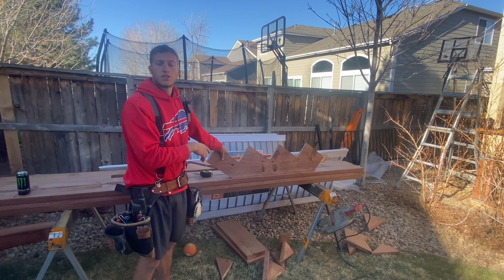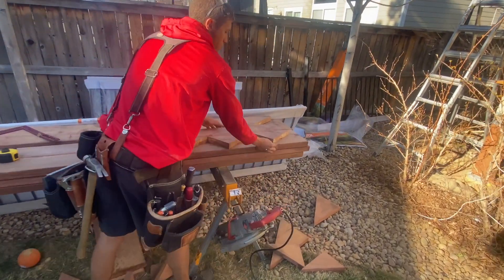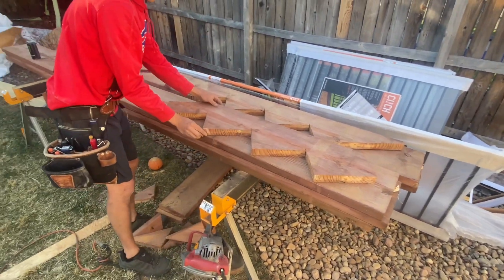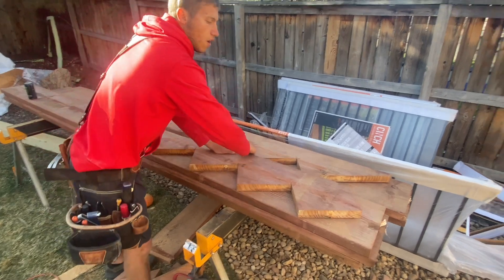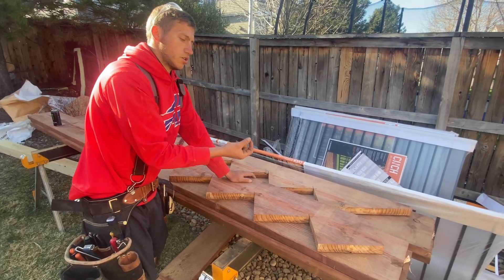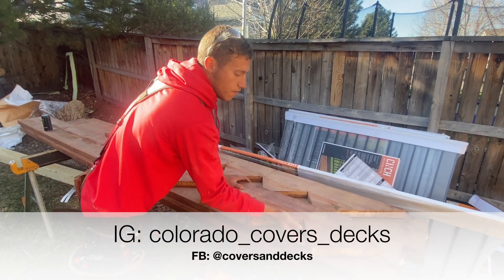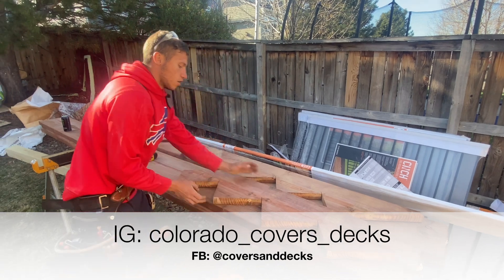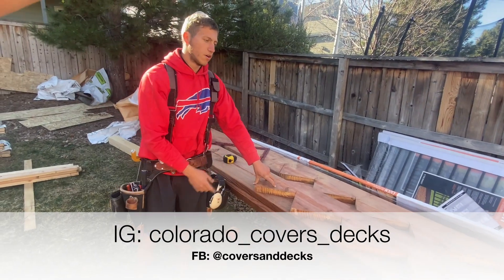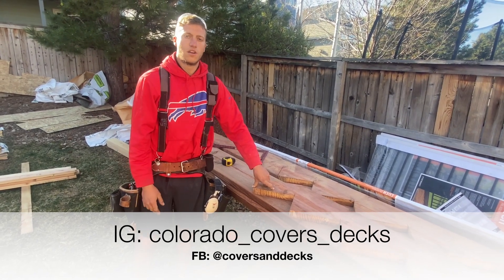Once I make sure that's good, I take my template and trace it onto two by 12. It's important to make sure that the points of the stairs are on the edge of the two by 12 — that really helps you get a good stringer. It's not always going to be lined up in the back because there's a little variation in dimensional lumber, so sometimes you'll have about an eighth inch bigger on the back side. That doesn't matter — what matters is that your front is all consistent. I'll trace this for however many stringers I need. For this one I need seven, so I'll cut out seven, hang them all up with stair strapping, and that's how you build stairs.